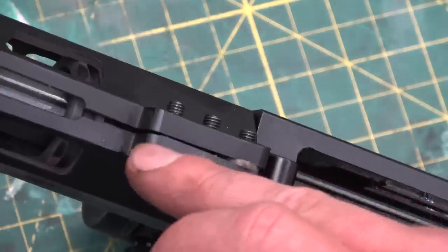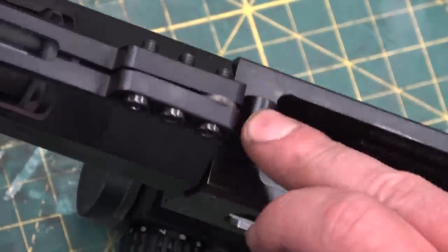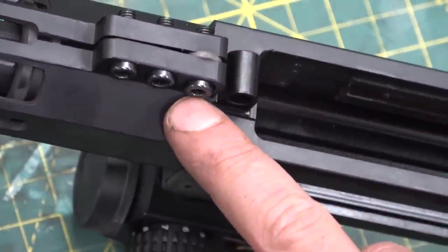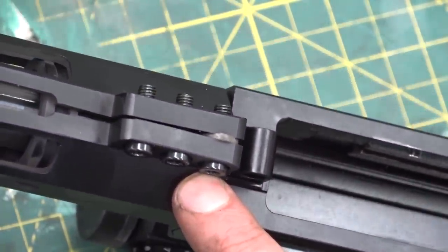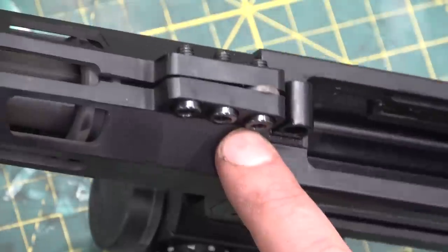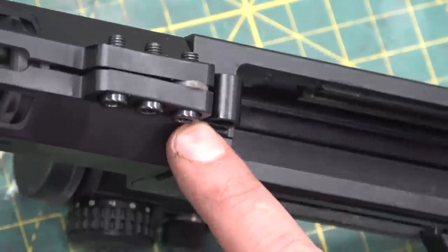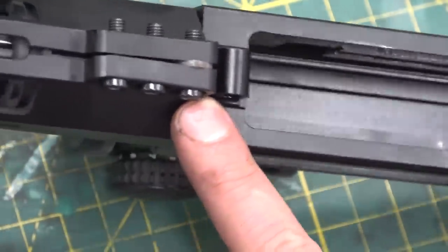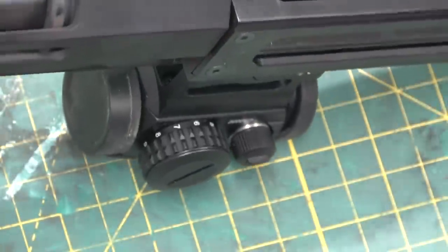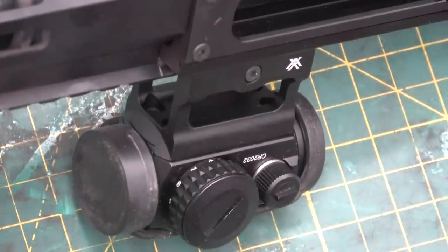And you can go with a shorter bolt that runs flush. And also, I don't know what is with this little plastic washer. Goofy as frig. Maybe they need it there in order to get that 50 inch pounds of torque that they require to set this, and I think they're worried about bending something in there. So that's that squish washer. No other reason for it but to keep it from warranty calls from 200 pound gorillas.